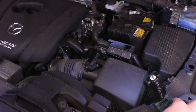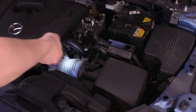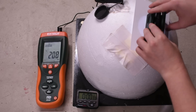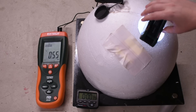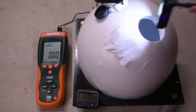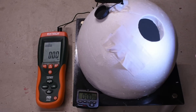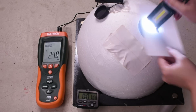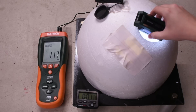Usually 400 lumens is enough to do the trick, but the flashlight mode is a bit more effective, though less practical given the shape. In the sphere we're seeing 209, 208, 211 — maybe 198 to 206 without the card. The flashlight sees 240 to 242, higher than the 200 lumens they claim there. But that 400-lumen flood setting is just pretty weak sauce, no way around it.